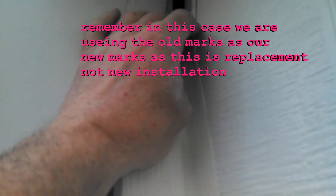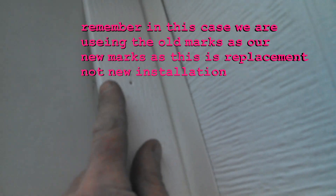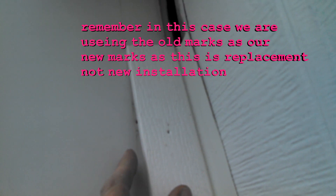You just want to make sure that you compress the vinyl against the garage door for a good seal — something like that — with a little bit of free play but enough to compress the seal. About three-eighths of an inch: that's the edge of the vinyl about three-eighths of an inch away from the front of the garage door, and that gives just enough flex for the seal to make a nice weather-tight seal.